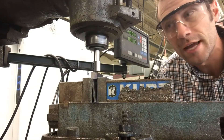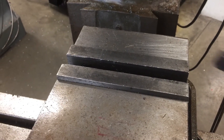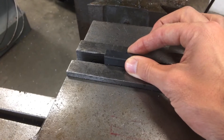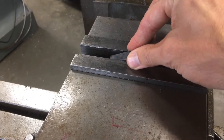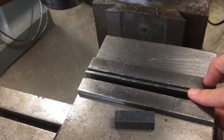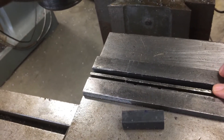We'll do this the old-fashioned way, step by step. It might seem obvious to put a part into a vise to hold it in place, but with a mill there are additional considerations. If we use a facing tool like an end mill or a bit, we could push our piece down and mess everything up. Instead, we'll use parallels — parts inserted into the vise that create a lip for the part to sit on top of while we're operating.